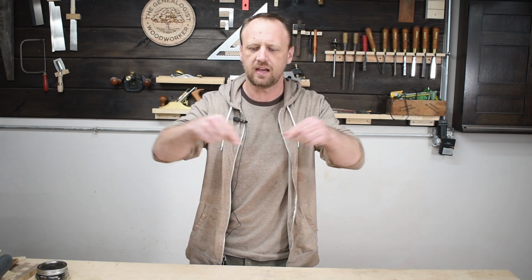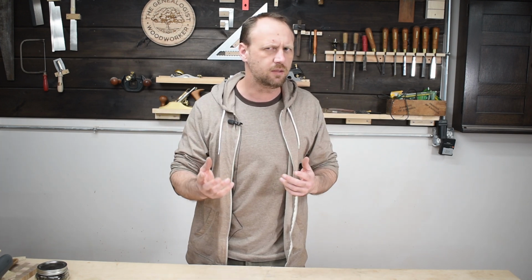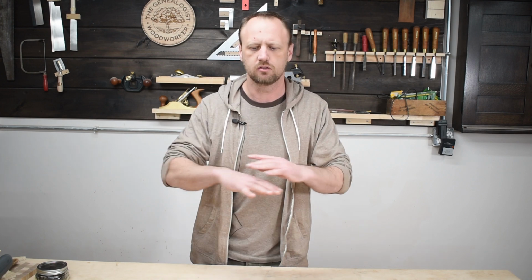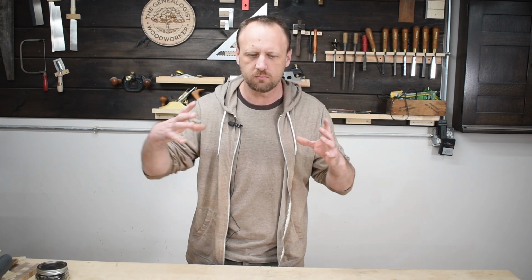But also, the outside perimeter of the sign is raised up a bit. So I'm thinking the best way to do this is I will make it kind of like a box lid. So plane down a board and then house it in a wooden frame, and I'll cut a groove in that frame so the board has a little bit of room for expansion and contraction.